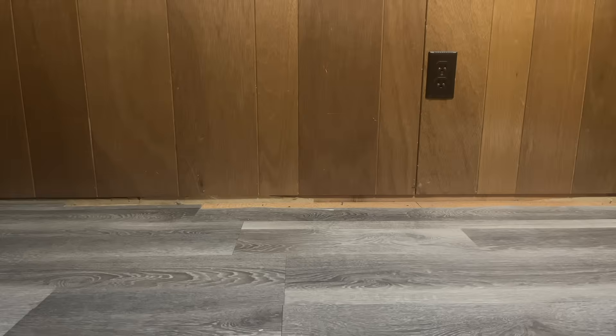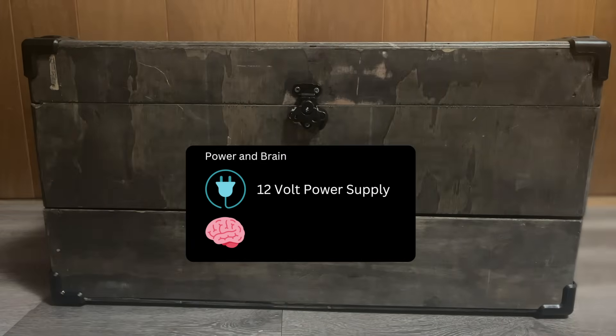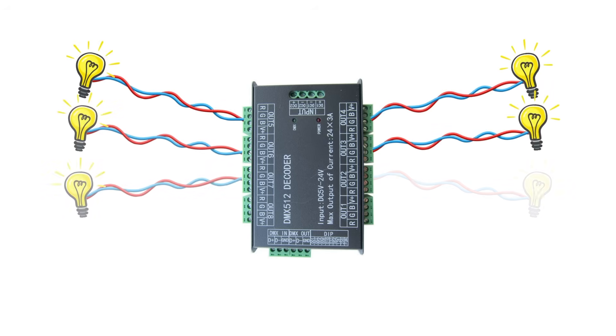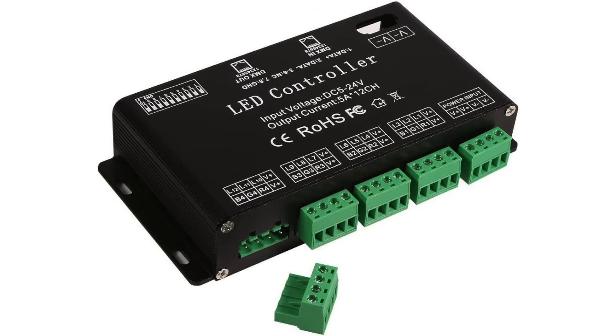Let's dive into some of the more technical aspects of this rig, starting with the distribution boxes. The distribution boxes house a 12-volt power supply and a brain called a DMX decoder. DMX decoders come in a bunch of different variations, but the ones I used in this rig were 24-channel RGB decoders, meaning they could separately control the brightness and color of eight individual fixtures at a time. I don't currently have these specific decoders with me right now, so I bought this smaller 12-channel decoder for this video, which lets me control up to four lights as opposed to eight.